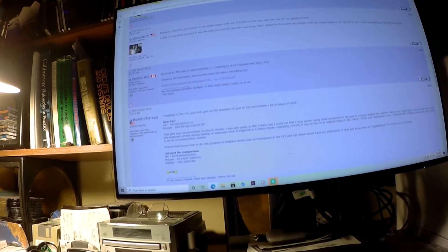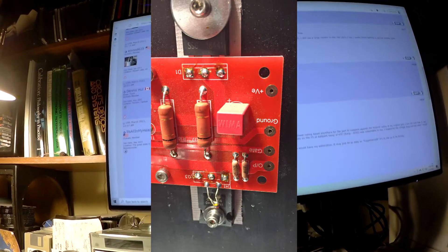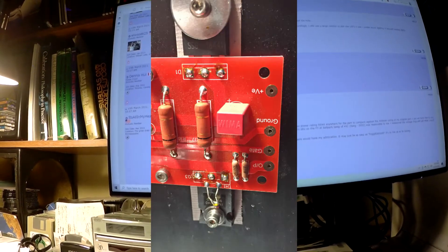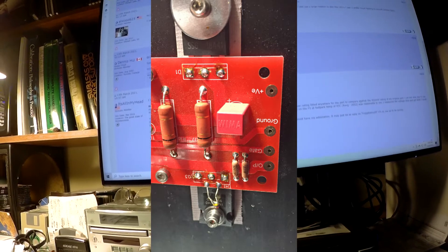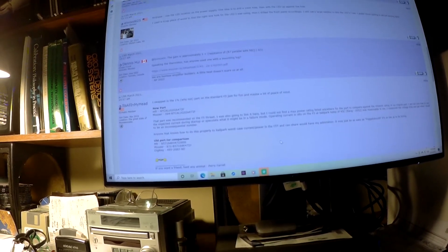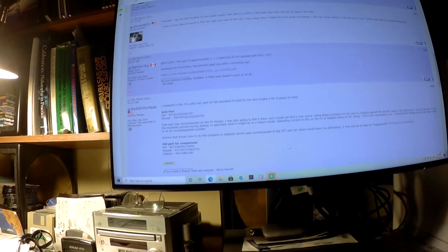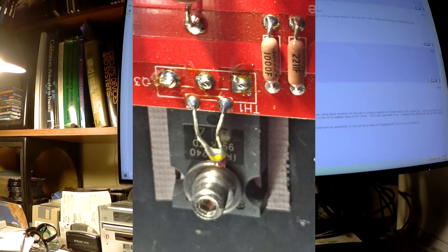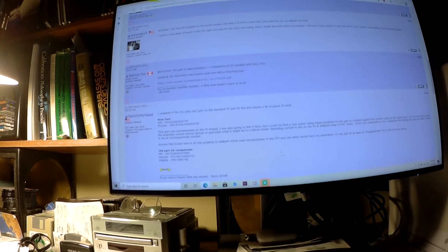So I just recently pulled the big washers off of the MOSFETs that had thermistors on them and mounted much more manageable 3/8-size flat washers, as you'll see in the pictures. What I found is the amp seemed to run a bit hotter, but the bias did seem a little more stable. I don't think I'm getting the drifts that I was.